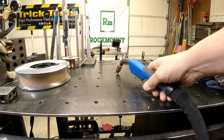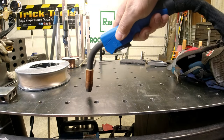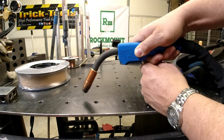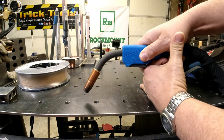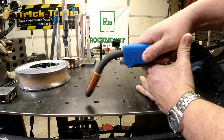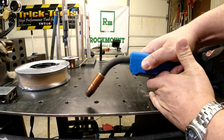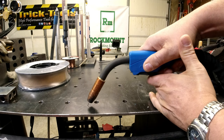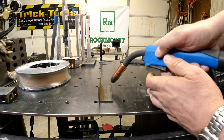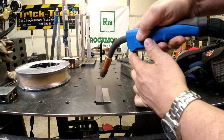When you start welding, your actual gun angle ideally is somewhere around vertical — angle it back about 15 to 20 degrees. Find something to prop your hand on. A lot of times I'll actually rest my hand in my glove so that as I go I can move and prop. Get your position, angle it into the bead, and when you run just slide your hand.